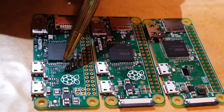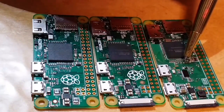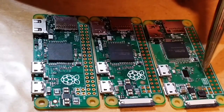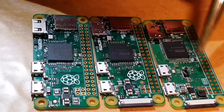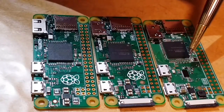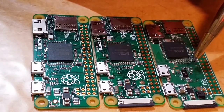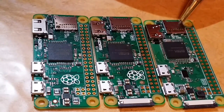They're using smaller components — these rows of resistors got shrunk and moved up a couple of millimeters. You can see there's some remaining space on the earlier boards, but on the Zero W they're really running out of space. They can't add much more unless they shrink some parts or integrate the wireless directly into the SoC chip. They could also combine the two USB ports or use a micro HDMI connector.